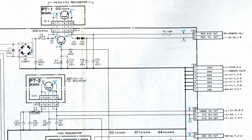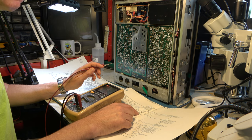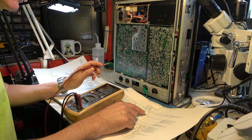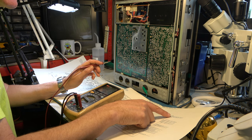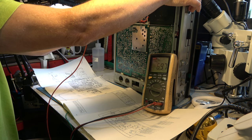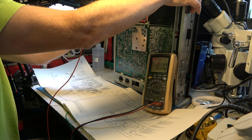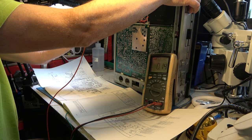Where is the regulated 5 volt derived from? The 5 volt regulated supply is derived from the 6 and a half volt — it looks like they just used a couple of diodes to drop about 1.2 volts. It's very odd that the 6 and a half volt is there and fused, but the 5 volt is not. Confirming: pin 6 is 6 and a half volts — a bit high — whereas pin 2 has nothing really there.